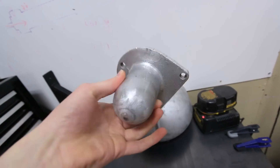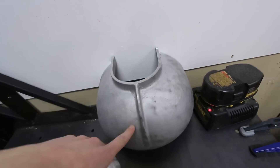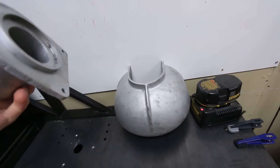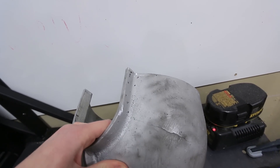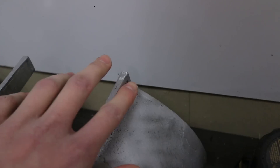Also, this is the top of the guard for the drill press — it sits like that. This is a pulley guard. I got them sandblasted, brought them to the sandblaster, and now they're relatively clean. I also started shaping them down in the parts that need to be shaped. There was a little overhang right here and I just used a dremel to take that off. Same thing over here.